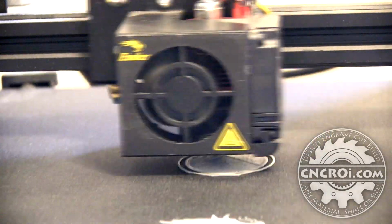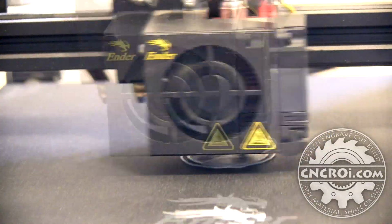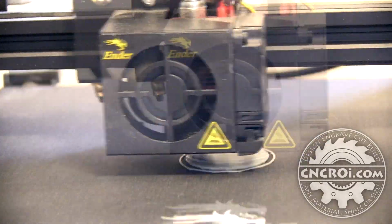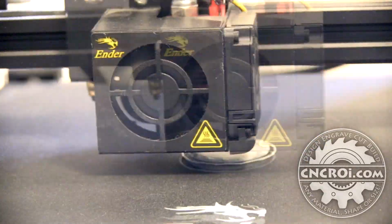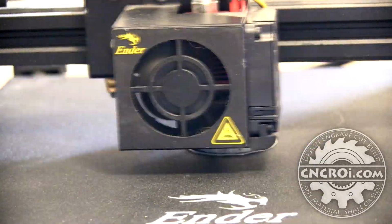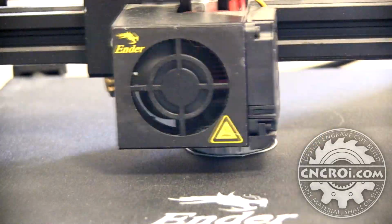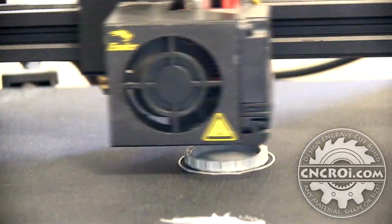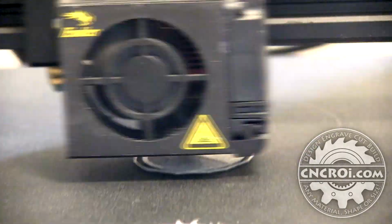The nice thing about 3D printers is that even this entry-level machine here is very, very precise, and it's repeatable. And what I mean by that is, when I was testing the tolerances out on these parts, I would take a day off, so to speak, between actually doing the first batch and then doing the second batch, just to see if the tolerances are kept between them when everything's turned off and back on and so forth. And everything was dead on. And I was adjusting things up by 0.1 millimeter, which is infinitely small. Like, it's a crazy amount of material to be playing tolerances with for an entry-level printer here.